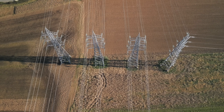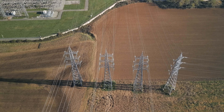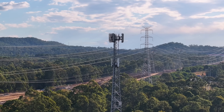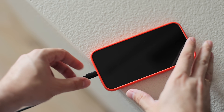E2 and E3 are mainly a danger to the power grid and other large-scale technical infrastructure. E2 couples to long transmission lines like power lines and is a threat to anything connected to them, including devices you have plugged in at home — it's actually kind of similar to lightning. E3 affects power and communication utilities but won't threaten small electronics since it's low frequency and won't couple directly into them as long as they're not connected to the grid. The main threat to our small electronics is going to come from the E1 component.